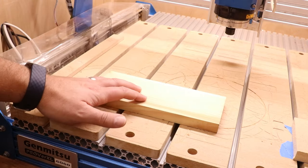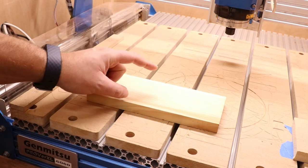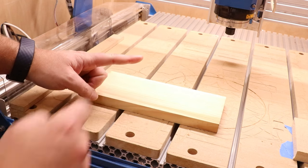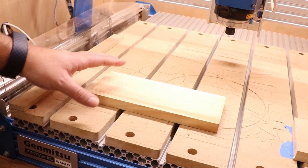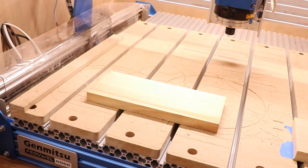You don't want to get blood on your material. I did this very early on — one of those small, thin 20-degree V bits went straight through the edge of my finger and was a clean cut and took it off. So learn from my mistakes: put your material on first and then sort the bit out later.